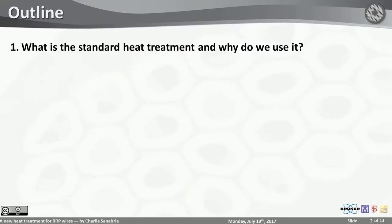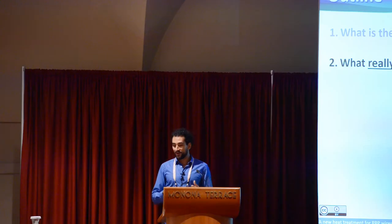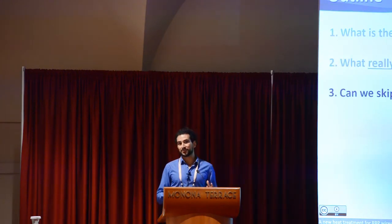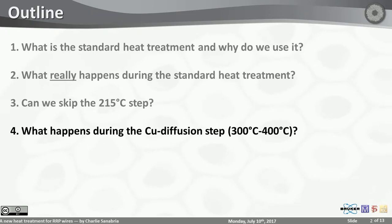First, I want all of us to be familiar with what the standard heat treatment of RRP wires is and why it was chosen. Then I will show you what really happens during the standard heat treatment of RRP wires. And once we're all in touch with reality, it begs the question, can we skip the 215 step? But what I really want to show you is what happens during the 400 degree step, which I now call the copper diffusion step.